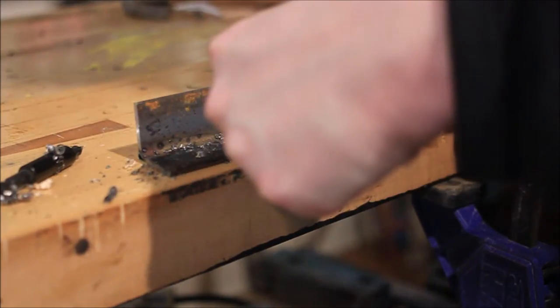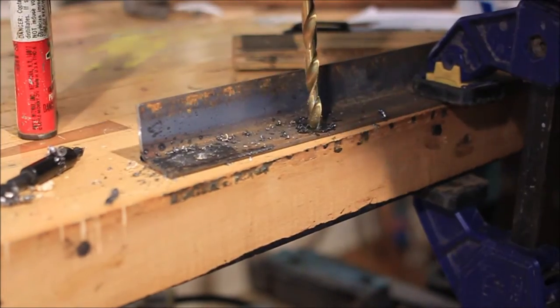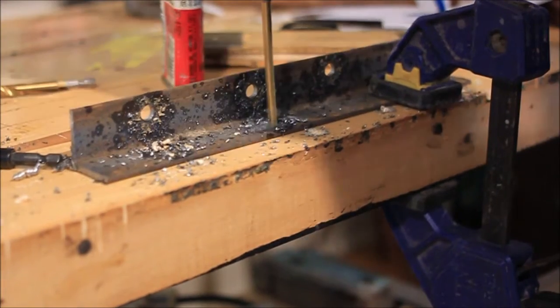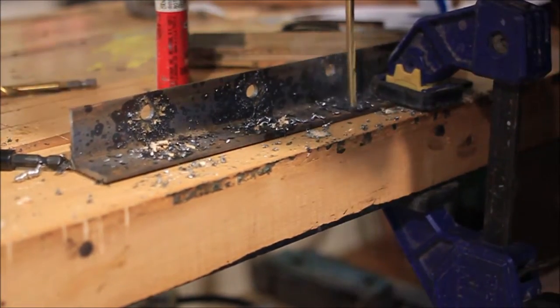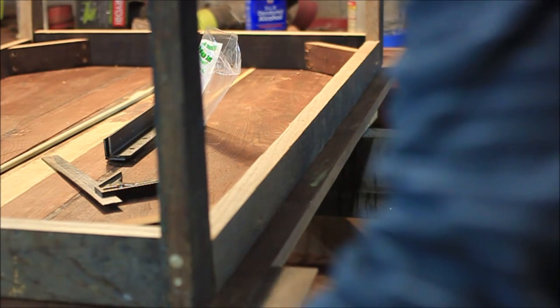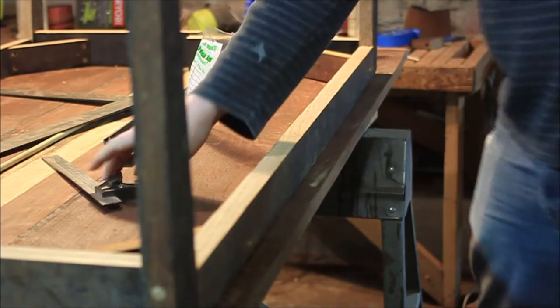It's just angled steel with a few holes in it. Larger holes for where the screws meet the table and smaller holes for where they meet the apron. Because where the screws meet the table, that's the broad surface of the wood and that means there's going to be wood movement, so the screws have to shift left and right to prevent cracking and warping.